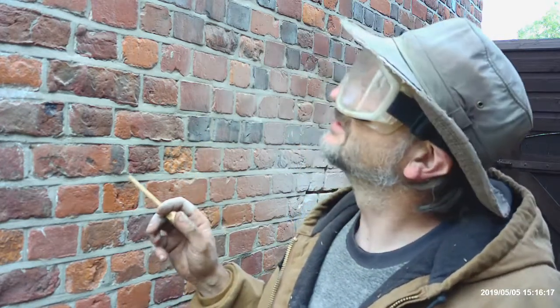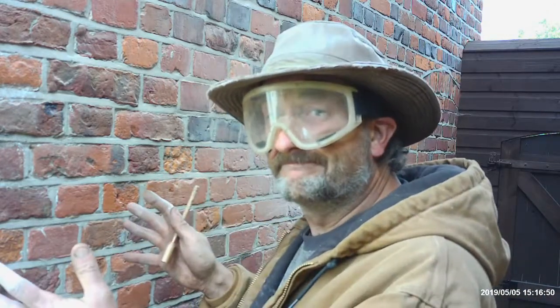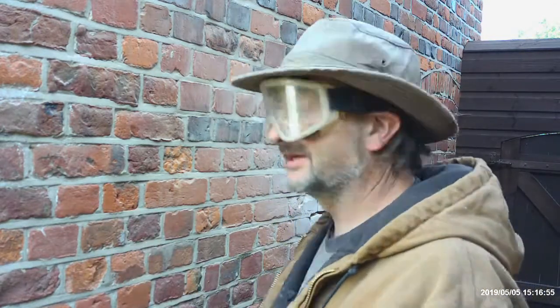That's all you can do, because I really don't want to disassemble this wall and put it back together. Unfortunately our Faversham red brick field is closed now, so we can't get them anymore. It's the only place that used to sell them, but because all these not very good builders have been around replacing them with things like engineering bricks, which are a completely different density, weight, and flexibility, they've pretty much naffed up every building in Kent, so all I can do is replace like for like.